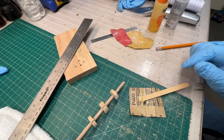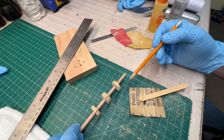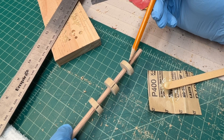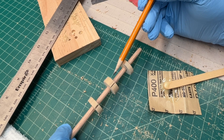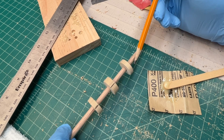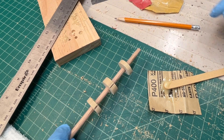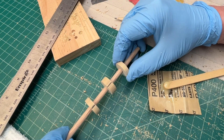I've got the epoxy mixed up and the former set up again. I'll space this out looking at my dimensions — this will be my top piece and then we'll adjust the center spacer, which is five-sixteenths of an inch wide or thick. These are one-fourth of an inch and we'll have a gap of one-fourth for the winding area for both. That's how simple the design was back in the day. Let me get a little epoxy placed here.